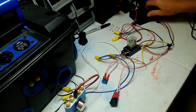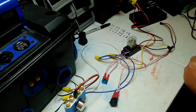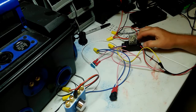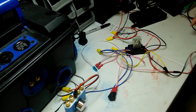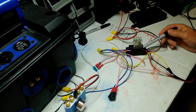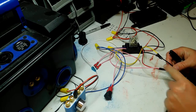Here's the battery over here, and here's the charging port I was telling you about — it goes to the battery first before it comes into the relay, tied together. Over here, as you can see, it's a bit of a jumble of wires, but we have the input port right here. This is the power supply right here, plugging in like that. The black and red wires are the power wires coming in — these are going to be pins five and six. The pink wire and yellow wire tie in from the power supply, splitting off — these two are what actually turn on the relay.